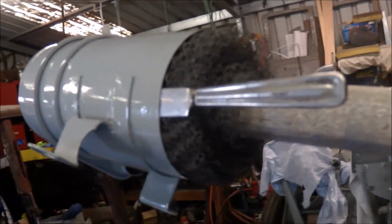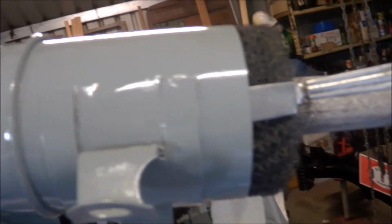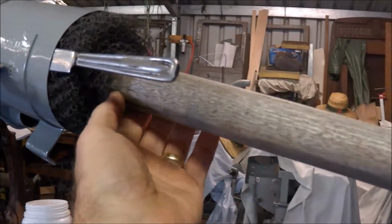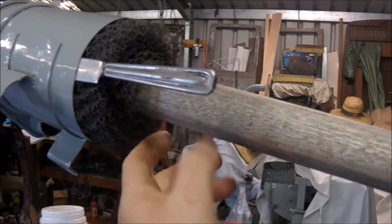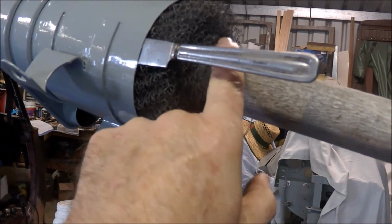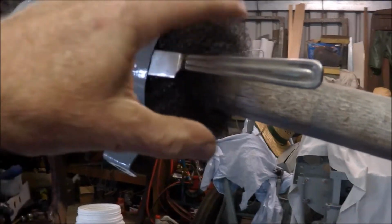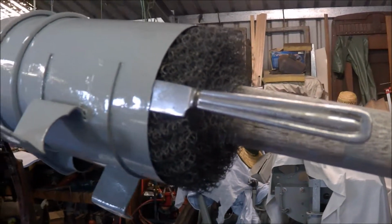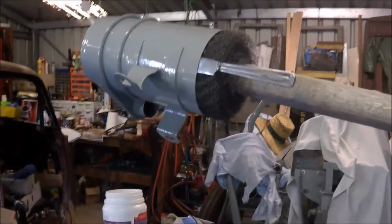There are actually quite a few bands of that gauze. There are 3 rolls. Each roll has two layers of mesh. And if you use a mandrel, which I've got pushed up inside the internal pipe, you wind it around, part on the mandrel, part on the inner tube, and then gently turn it and it will fit back in. So it is possible to clean them.